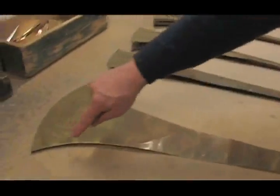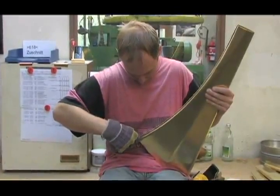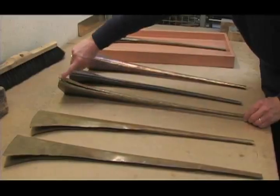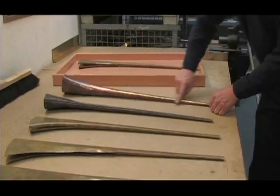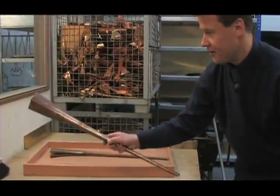These samples show the whole process of the preparation of a bell. First the maker has to cut out, then bend them over, cut some teeth out of one side, overlap them and hammer them to the opening of the bell. Solder the seam and hammer it another time. Finally buff them off a little bit so that we get the raw start of a bell.